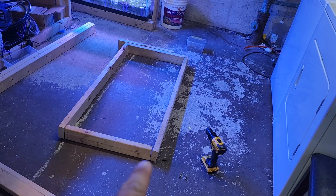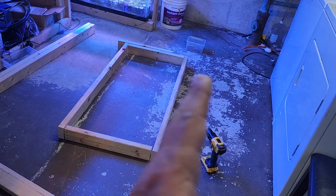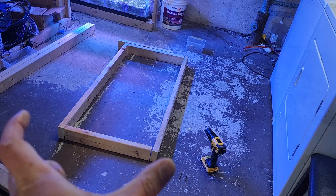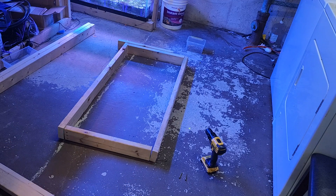This corner right here — the wood is warped a little bit or not quite planed correctly. So what I'm going to do is grab a clamp and clamp it together so I can put the screws in to square it up a little bit better.